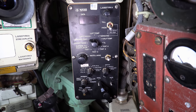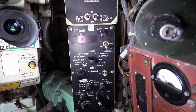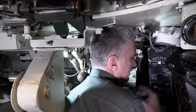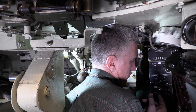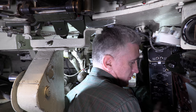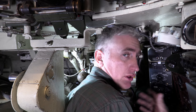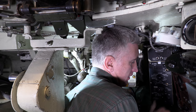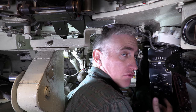You'll see a lot more dials, knobs, buttons, and switches than you'd expect in a typical Centurion — this is courtesy of Bofors armaments. They have put in a proper fire control computer. You enter in various data: air temperature, wind speed, wind direction, and you can select exactly which version of ammunition you're firing — Sabot or AP. The main selector at the bottom right is for the fire control computer: HE rounds, smoke with HE selected, AP depending on version, and KSP gives you the ballistic solution for the machine gun.